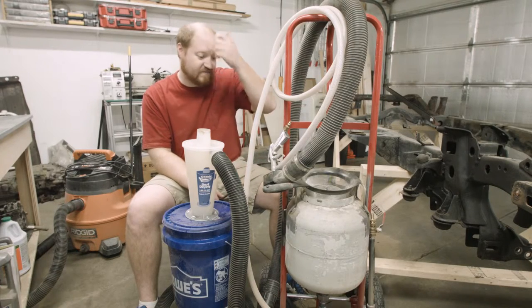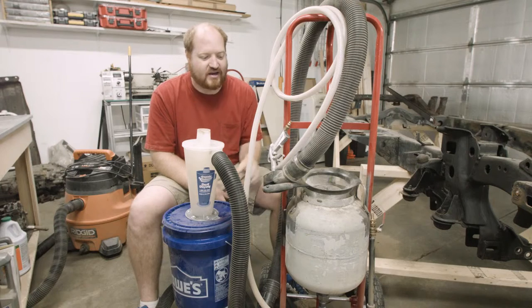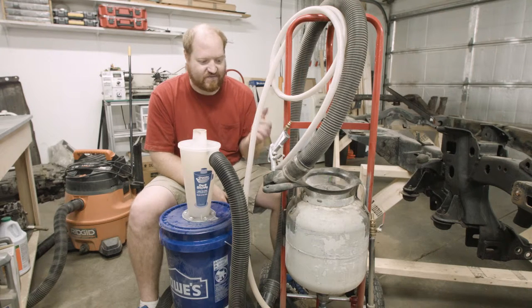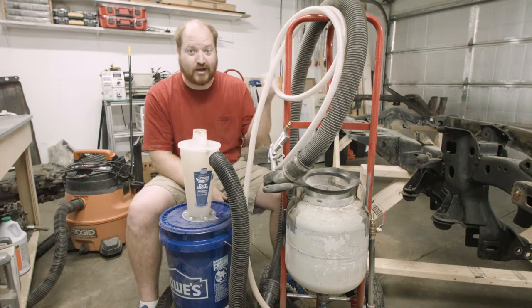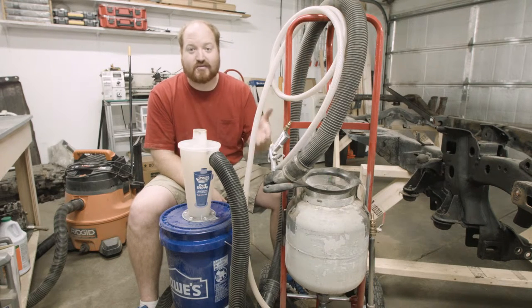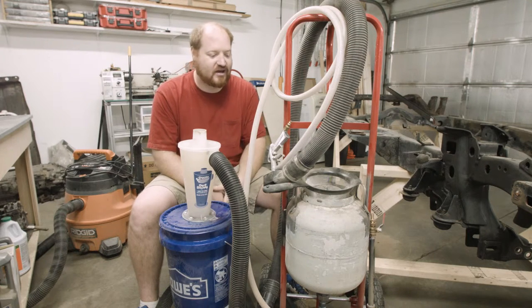For the expectations of the media collection, I thought it was going to do a lot better than it actually does. If you think about it, the velocity that the sand is coming out of the gun and hitting the metal — there's a lot of energy there. To imagine that a vacuum system would overcome that but actually render the gun useless — because if the vacuum is strong enough to pull the sand in, that means the sand coming out isn't fast enough to do any work on the metal. So as far as the media goes, being the larger granule of sand, not what I expected. And I think that's okay.